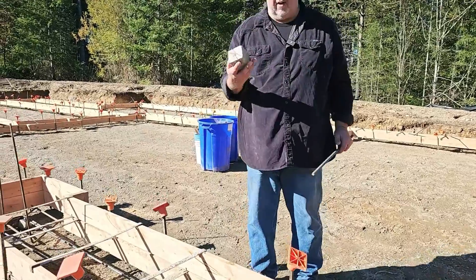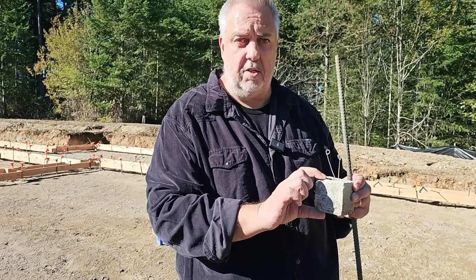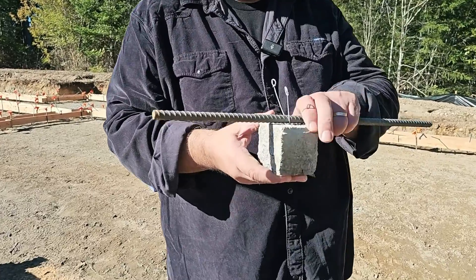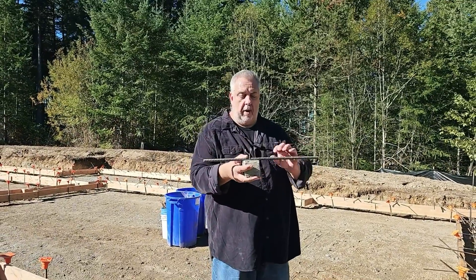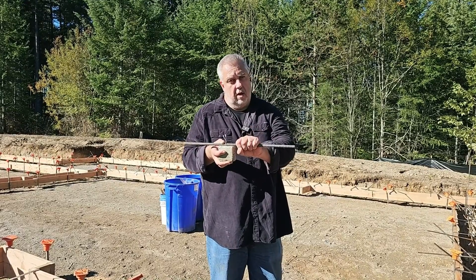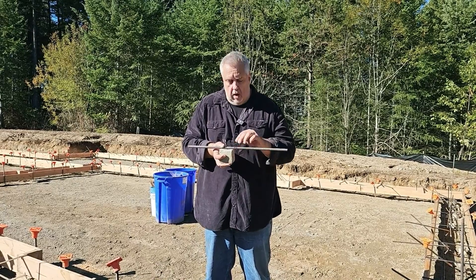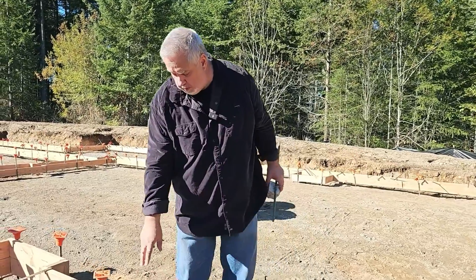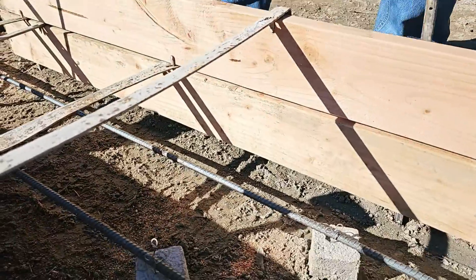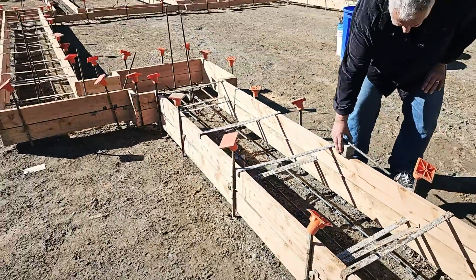So how do we do that? There's a product called a dobie block — roughly about three inches tall. They sit on the ground and you put the rebar on top and tie it. Now your rebar is displaced off the ground and the concrete can come in and create that composite action. The dobie block is not a dissimilar material from concrete, so think of it as just a larger piece of aggregate. The wire ties are how we position the rebar. You can see there are bars with dobie blocks sitting down supporting them throughout the footing.